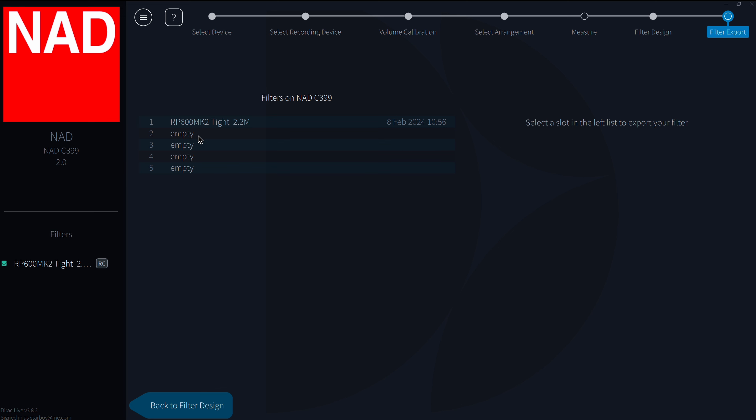The filter curve that will be applied is a classic tilting curve where the bass is raised a bit under 100 Hz, and then there's a smooth tilting slope in the top end. If you had a completely linear-measuring system it would sound crappy, tinny, and annoying. The ear really prefers that tilting curve — I know very few audiophiles who would prefer a completely flat response. So we proceed to the filter export.